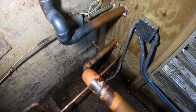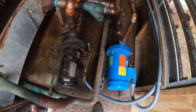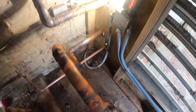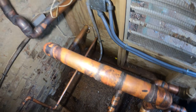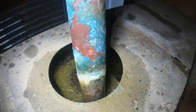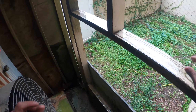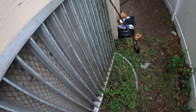Let's go ahead and start the pumps and make sure there are no leaks. Got the water filling up, turned on the pumps — everything's looking good. That pipe feels cold so we must be returning water. Got water coming back to the tower with good pressure.